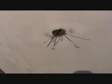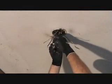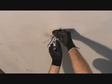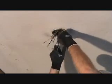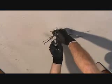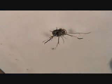You probably want to set like that, but I've already determined the breaker and the dining room light went off too on the same one. That's off, so I know they're off. Okay, I'm gonna just remember where all these wires are right now. That these two were the ones that were screwed together. Same circuit. Okay, just remember everything as you go, step by step.